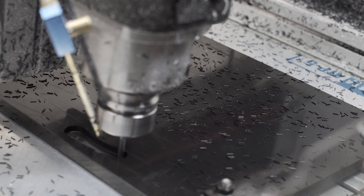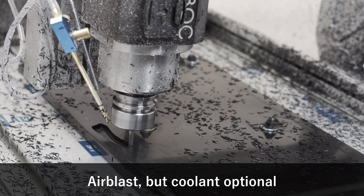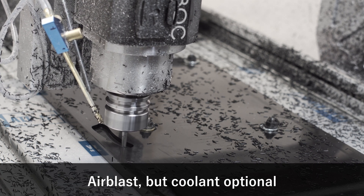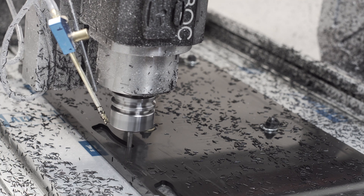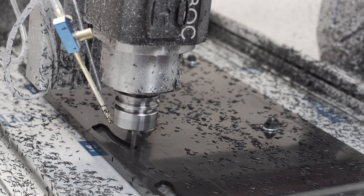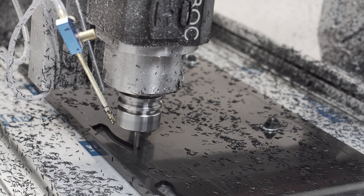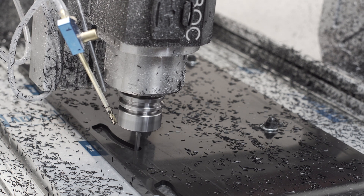I'm using pure air blast with no coolant, although for later runs of the same toolpaths I turned on the coolant. I didn't really see a noticeable difference. Some folks online said it gave a better surface finish because it essentially cooled the plastic and kept it from melting. But I didn't really have melting issues anyway, so I think coolant is probably optional and just air blast is fine.